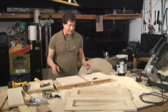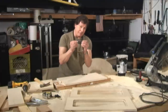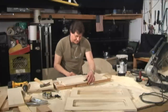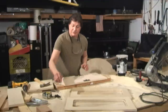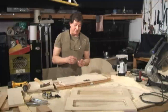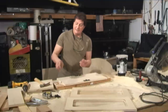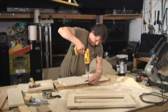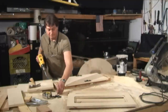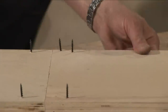The other two sides are going to be two pieces each. I'm going to put those two pieces together and then with a butt hinge, center that hinge on the seam of the two pieces and put it in with some screws. I'm using longer drywall screws — the long drywall screws are a piece of cake: you just drill it in and then grab your hammer and tap it off on the other side. To get the hinges set, I usually just put a couple of screws in to get started, but then I go back and actually fill all the holes.